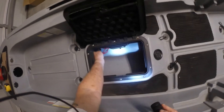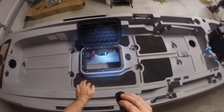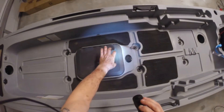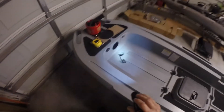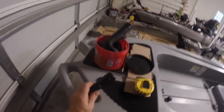One of the extra switches will be for the fish finder. The lights will hook up to the bow and stern channels. I'm pretty sure I'm going to mount the fish finder right here and run the transducer through the hole and down through the scupper. They created a cavity on the underside for the transducer to mount in — I thought that was pretty ingenious.